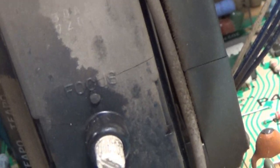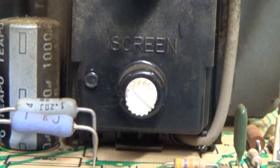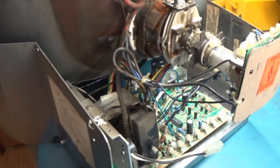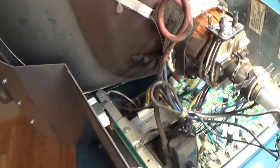Yep, it's cracked right there - right across the focus. That appears to be the only crack, which is amazing. This might be a very low-hour K7000 - it could be relatively low hours. It has the original flyback, original caps - everything on here is absolutely original, so it's going to need a rebuild for sure.